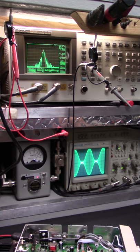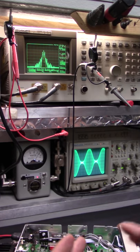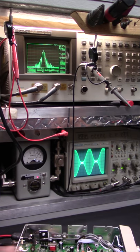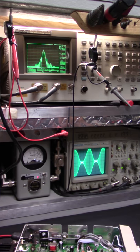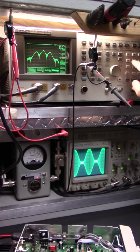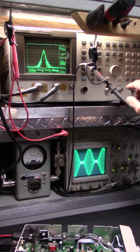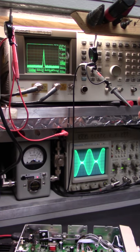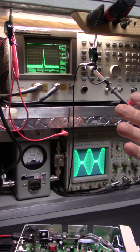Super important, extremely. Not at 110. Yeah, it's got some relevance. But to keep your power at that fundamental frequency without going into the adjacents, that's where you'll lose all your power. All of it. Gone. All right? So let's go to, say, 50 kilohertz. Which really shouldn't matter, you know. Hold on. Most important, 30. 30 megahertz either side. There's no intermodulation distortion, no weird shit, no out of band. All right? This is what you need to pay attention to.